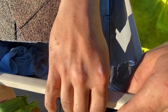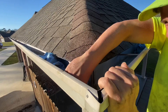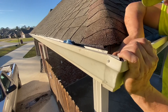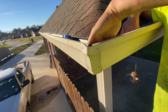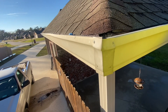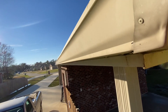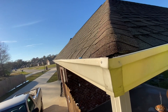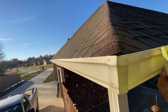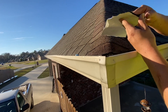I think we'll need one more little section here. These rolls come in six-inch width — I think there's a nine-inch roll too for commercial gutters — but 25 feet long. Oftentimes if you have a 90-degree turn like this, that's where they're going to leak. Sometimes if a limb has punctured through the bottom of the gutter, that could be an issue too. But most often per repair you might use a foot of it — even two 12-inch pieces — and you can get about ten fixes out of a roll.